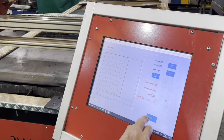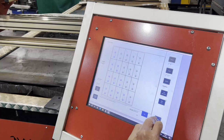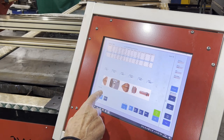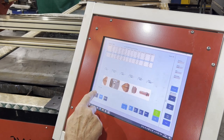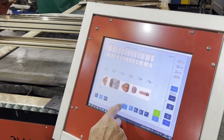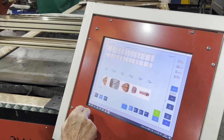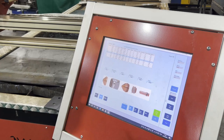So that's now done. Next — choose the correct current and process. There's the Max Pro 200. We've got 10mm thick material, 130 amps, oxy process, mild steel. If we change the current, then we select different speeds and it automatically sets all this lot up. We have to set the current on the plasma manually, then press next.